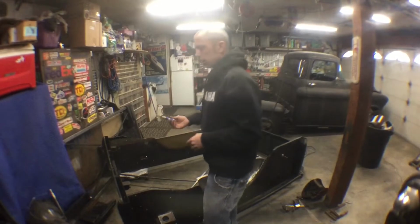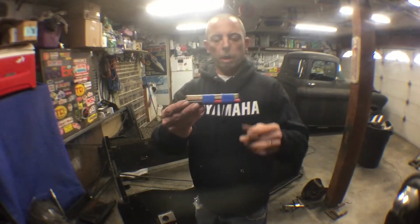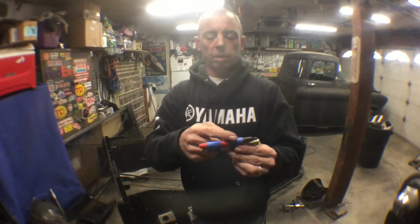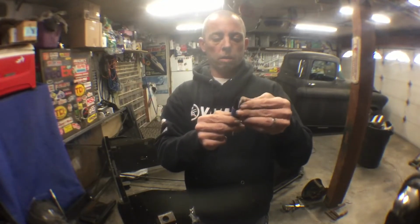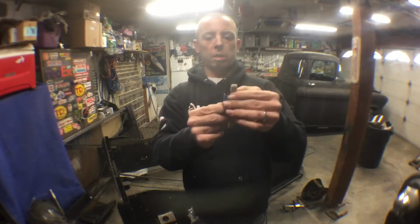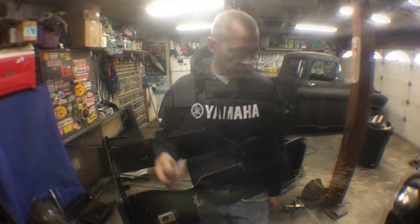Alright, I was just using another little tool I thought I'd share with you guys. Take some popsicle sticks, got your Sharpie. I wrap the tape around sticky side out first, so these can slide and adjust. So when you need to scribe something, you can have different adjustments, inside and outside scribing. Pretty easy to do. Good little trick, helps out a lot.